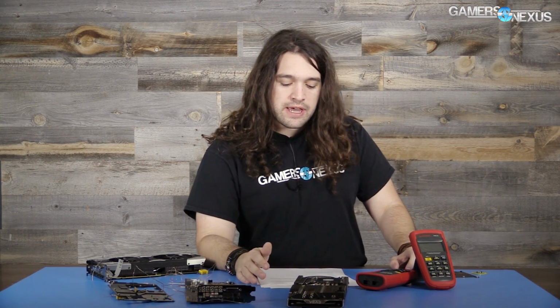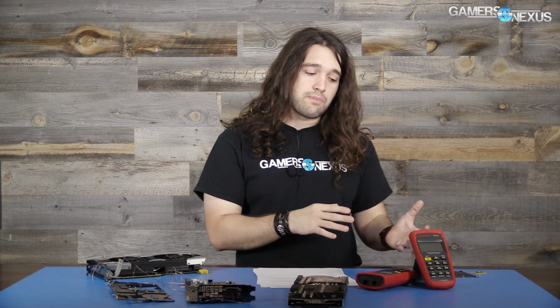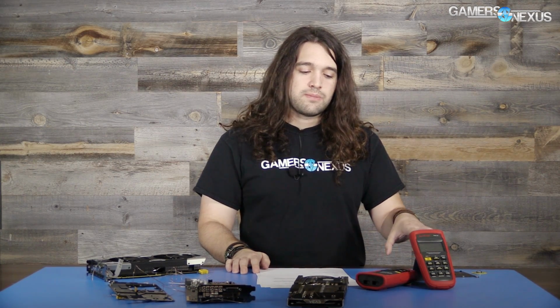With thanks to Buildzoid for joining for that and for his expertise, it's clear to me at this point that there's no thermal issue with the EVGA cards, at least not one that kills them. The issue is something else, and it's probably something like individual components. It might be in the supply chain. Maybe they got a batch of bad caps from their supplier, or it could be something else like workmanship or whatever other manufacturing defects. But these things are not dying because the VRMs are getting too hot. That's even true for the stock card before the VBIOS and the thermal pads.